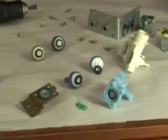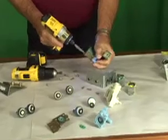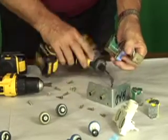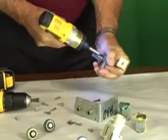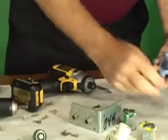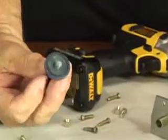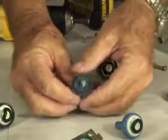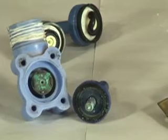Some of the other valves that we have here, we can disassemble. Again, removing the mechanical fasteners. This allows us to take off the magnetic coil, and we have the internal plunger. Removing that plunger, you can see again it's corrosion buildup. That's a result of the filter screen allowing some corrosion to move through it. But there, the valve seat head is completely contaminated and would not seal. So you would get a flow of water coming through there intermittently. It may work 10 times and then not work, or work 20 times and then fail to work.